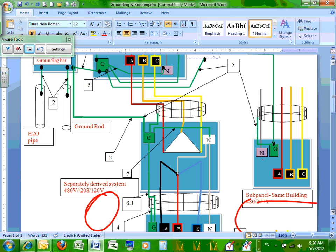So that's why they don't want to, because if you bond the conduit from both sides with a wire, what's going to happen to the current? It's going to split. Some will go through the conduit, normal neutral current, not short circuit, and the other will go through the ground. Can I just get your attention that there is no bonding in the second panel at all? And then you have to have an equipment ground conductor and equipment bonding jumper on the load side. Done. Cool?